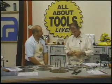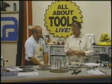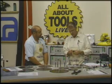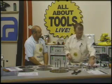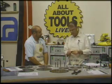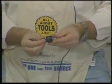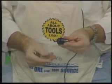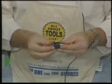replaced collets. Well, some of the things I learned about collets, and some of it is intuitive, it makes sense once you hear it, is all collets are self-releasing. Helps if you use the right size. Right. But when you release the pressure on the bit it should just sleeve right out, as it should sleeve freely in. We always tapped ours with the wrench. That may tell you something.